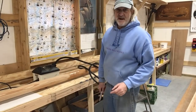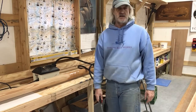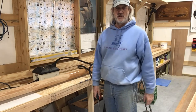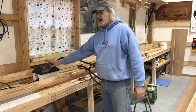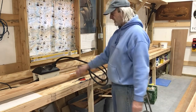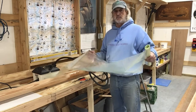We've made big progress getting the stations pretty well true and fair, and I decided it's time to go ahead and see if we can steam bend some strips that we can put on the ends for the stem ends. We need them on the bow and the stern, and I've got my trusty wallpaper steamer here that I've used many times before. I've already got it plugged in, got some water rolling, and I'm going to do this in a bag.